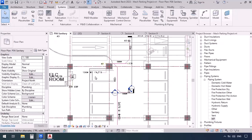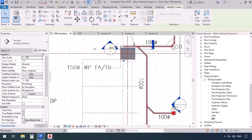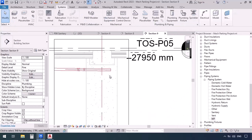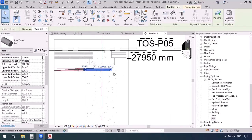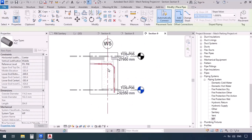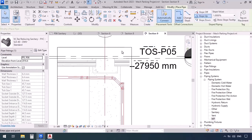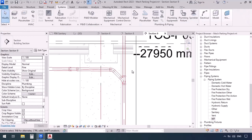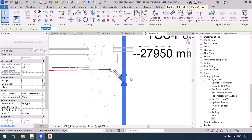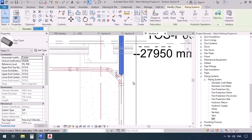Now we have to draw the riser — size 150, from above to below. Take that previous section, flip it, and place it here. Right-click and go to view. You can see the beam — the pipe has to go beside it. Right-click and draw a pipe, then at a 45-degree angle, click, move down, click and escape. Click on the elbow's plus sign to make it a T, then right-click on the T and draw pipe, move it up and escape. The size said 150 but we drew with 100, so select these three and change diameter to 150. Then move it to the left, closer to the beam.